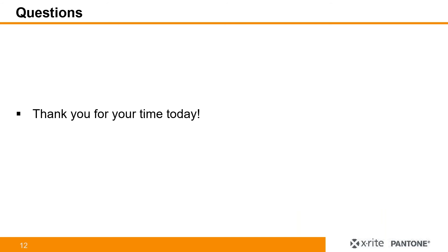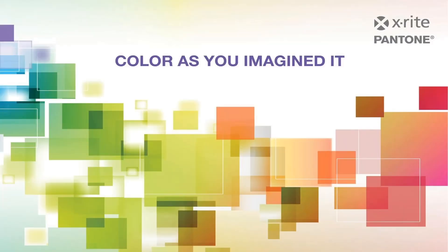So this was a quick 10-minute briefing on flexible film and substrates, but we wanted to bring awareness to the interference issue you can see based on certain substrates depending on what you're measuring. We recommend that to test this, all you have to do is measure a standard several times, then rotate it, and see if you see the variation. The backing material you use is extremely important, as is the instrument you use — we highly recommend the eXact XP because it reduces that variation when measuring on flexible film. Thank you so much for your time today. We want to open up for questions if you have any.